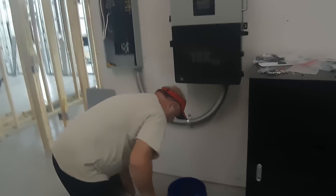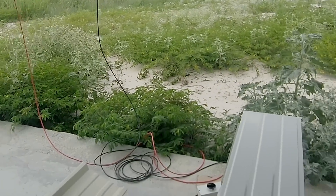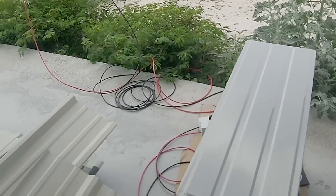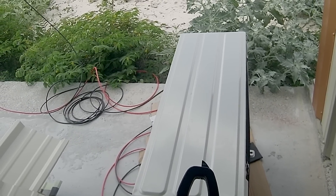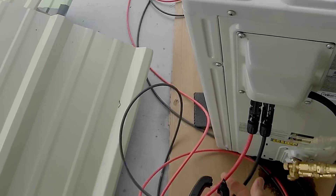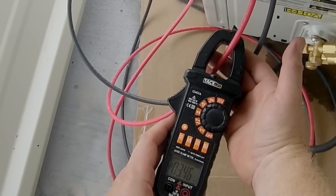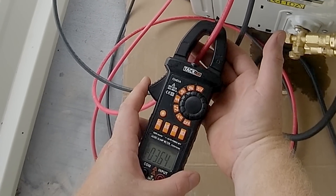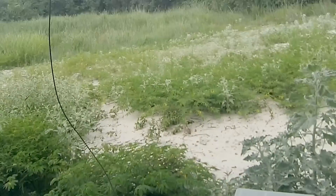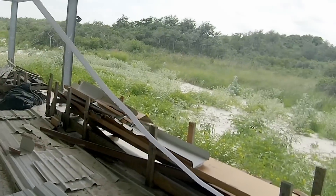It's cooler in here. Dago says he's getting one. So it's overcast right now and it's still running, but I think the compressor slows down. Quick current test — it's only pulling 3.4 amps. So apparently it speeds up and slows down to match available power, which is exactly what it's supposed to do.